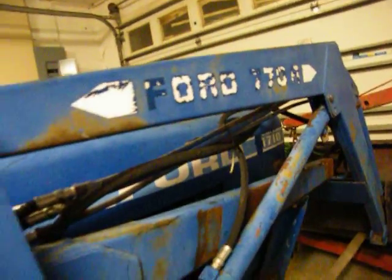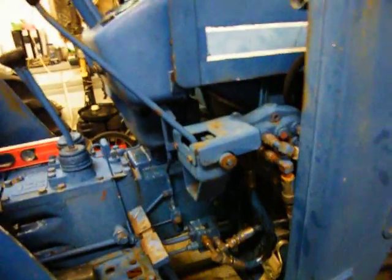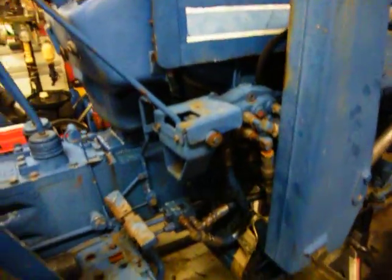When I get everything ready and the hoses off of it, I'll take a bar going across here and over there, put two pins in it one on each side, and squeeze that thing together as far as I can get it. I'll try to pull these up over and then when I get that done I'll hit it with a welder down at the bottom some more and tighten these down real good — that'll stiffen it up. I guess when they worked on the hydraulics they forgot those two bolts and couldn't get them in after the lines were hooked up. I'm level both directions.